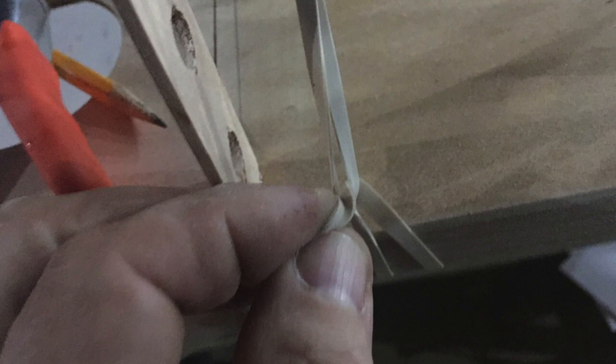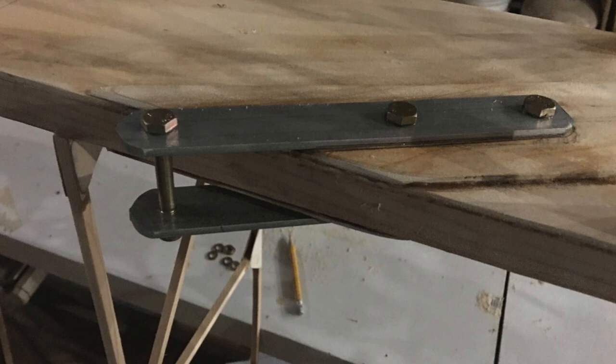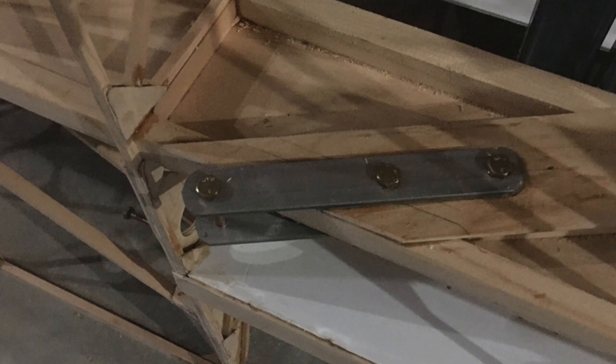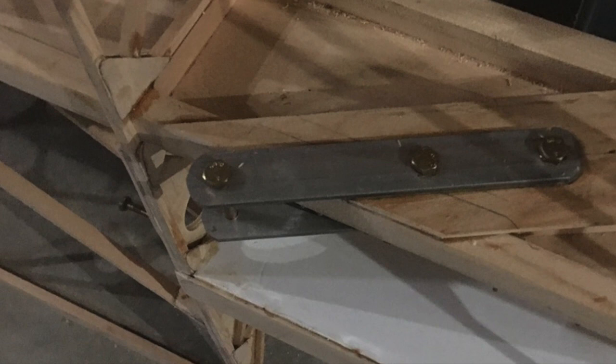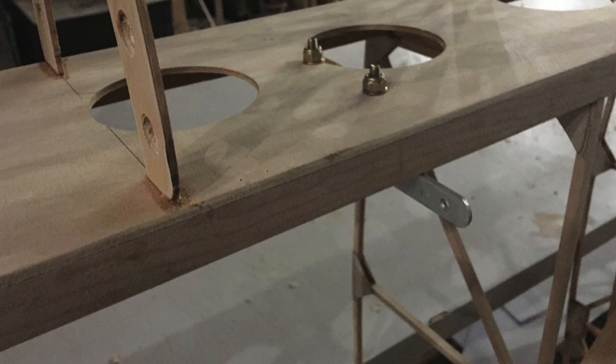I was very happy how the plywood wrapped around these nose ribs with very little dimpling. We'll see how the final product turns out. I used a lot of rubber bands and clamps to hold these ribs in place until the T-88 glue dried. At this time, I also glued the wing attachment brackets in place. This picture shows a potential problem — I installed, per the plans, the mounting hole 5 eighths of an inch below the front and rear spar. On my next plane, I'll make it 7 eighths inch below the rear spar to account for the quarter inch rib below it. I'll try to come up with something to create a recessed cavity around this bolt, as well as the rear landing gear strut bracket.